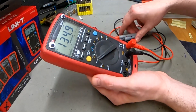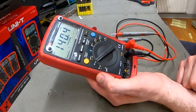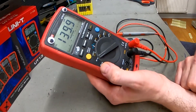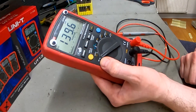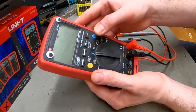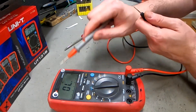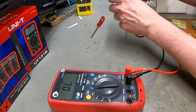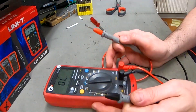I never measure amps with a multimeter — we have other stuff for that — and I don't use hertz, that's probably just for AC. But the two things you do need in a multimeter are the ability to measure DC voltage, and the resistance function, especially the continuity beeping sound. You can check continuity using the diode/sound symbol and measure if one part is connected to another. For example, you could check if scissors are connected electronically — probably not. Those are the two essential functions.